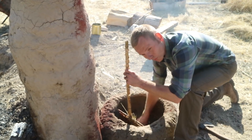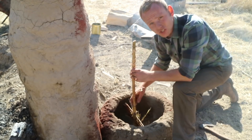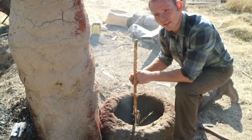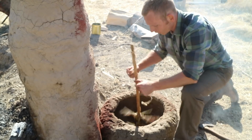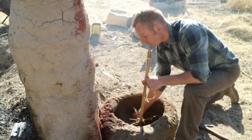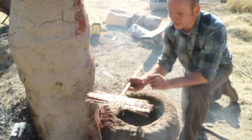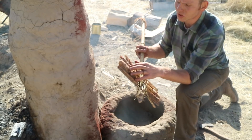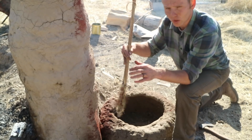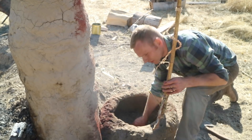So we made a blower, more or less imitating the one that Primitive Technology made. That thing he made is genius — it didn't happen in history, but it's a way of bypassing the need for leather to have your bellows. We've made it bigger so that it will be easier to get more air into the furnace. We're having a hard time with this bearing block — it keeps moving, so as soon as that fits in place, it'll work. One of the secrets that's made this thing work is that we've put in a whole bunch of pine pitch on the blades. That's partially to seal up the gaps, but mostly it just adds weight, which means we don't need a separate clay flywheel.